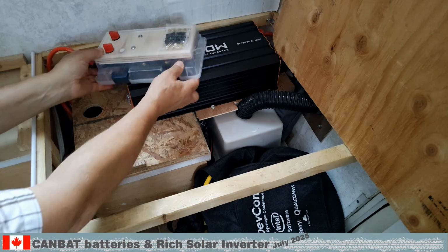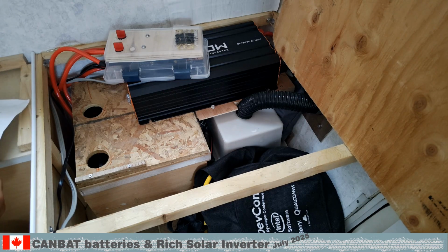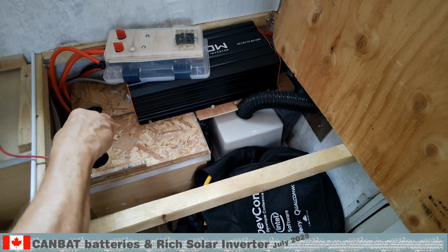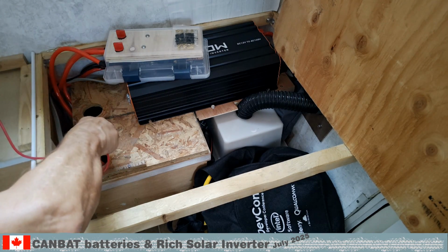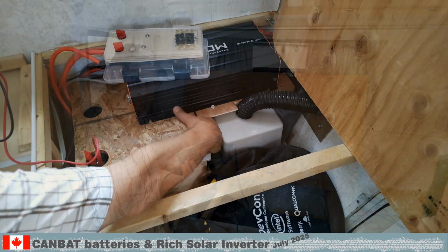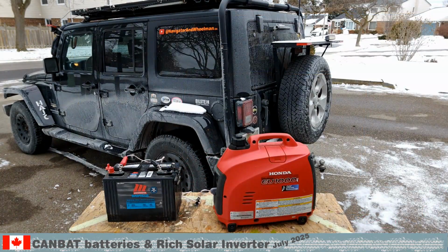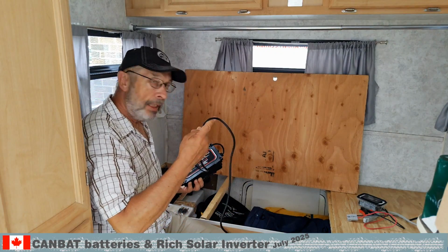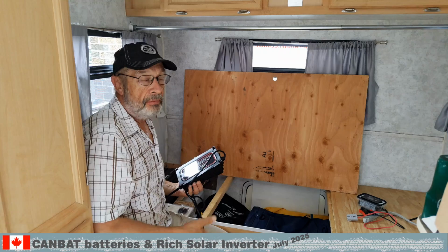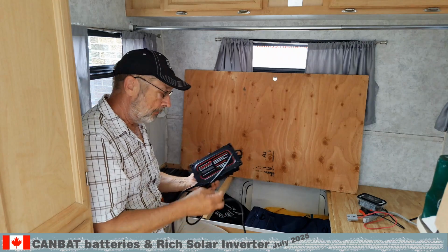When I lift up the switch box, two holes open up to access the positive terminal for each battery. To charge the battery, I turn the switch on the switch box off and therefore isolate the battery from all other equipment. Then I connect the clamp to the positive terminal and the other to the negative terminal hidden behind the box. This one uses 410 watts on 120 volts, so it does work with our Honda EU1000 generator. And it puts out 25 amps to load the batteries, which mathematically should take 4 hours for one battery or 8 hours for both.